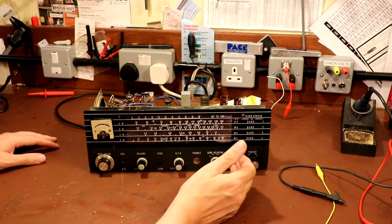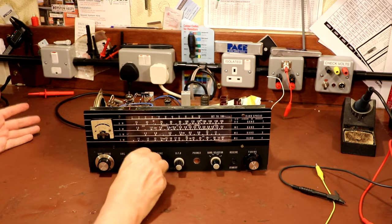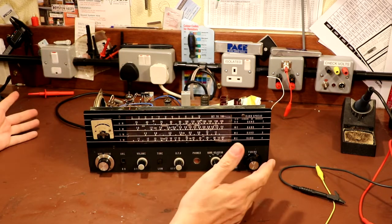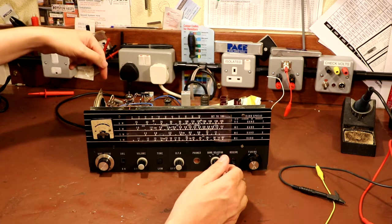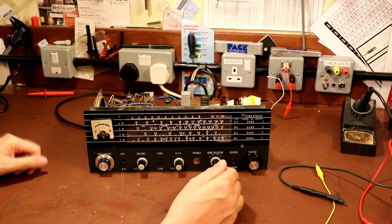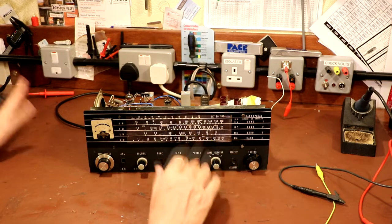There are quite a few places where this 50 hertz could be coming in. It could just be down to really bad wiring - the wiring inside this has been hacked, a lot of the grounds have been disconnected and stuff like that, so that's in an atrocious condition. The other place we can pick up mains hum is up here - we've actually got valves with AC heaters in them, so in some cases we can pick up hum from inside the valve itself. We can also pick up hum from the mains transformer here - it's actually installed relatively close to the output speaker and the output transformer, and it's not uncommon to get direct coupling between the magnetic flux. It'll directly couple into the speaker itself and into the output transformer, and generally everything's quite untidy in this radio with quite a lot of poor grounds.